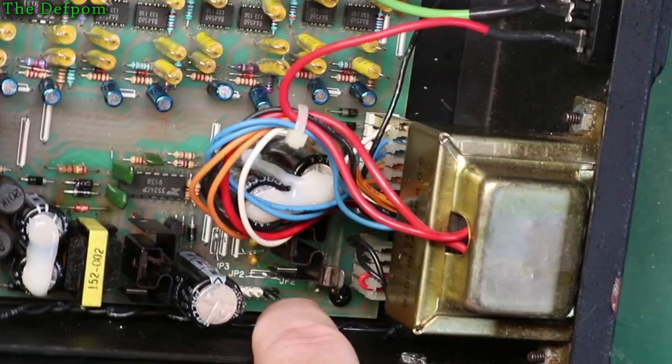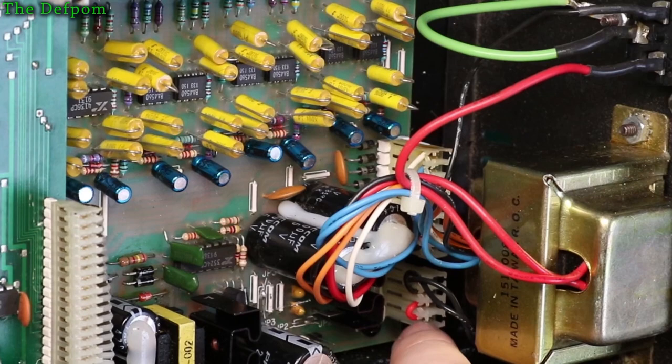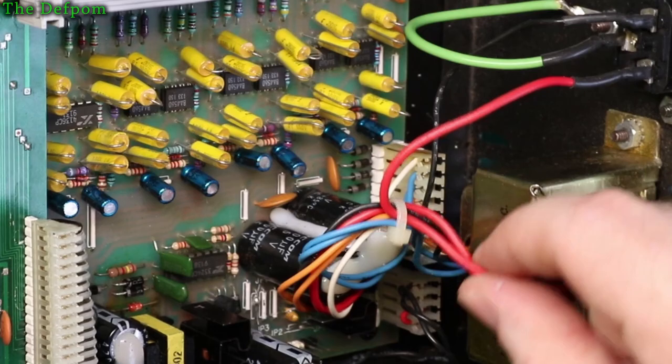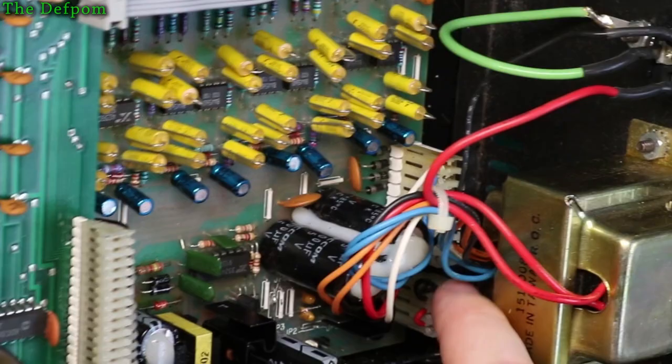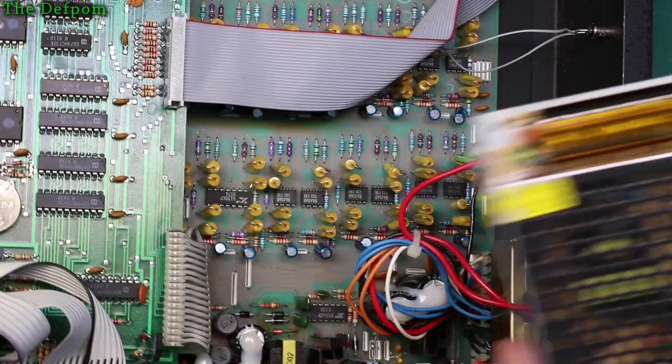And what those do is just a switching option. So if I take this jumper block out, turn it around, plug it back in again, that loop then becomes the connection, replaces the switch, so it's always on. And that energizes the neutral here to the neutral to the transformer, which is one of these other red wires. That one there, alright? So it links those together. So they run through that loop there. So the power will always be on going to this.